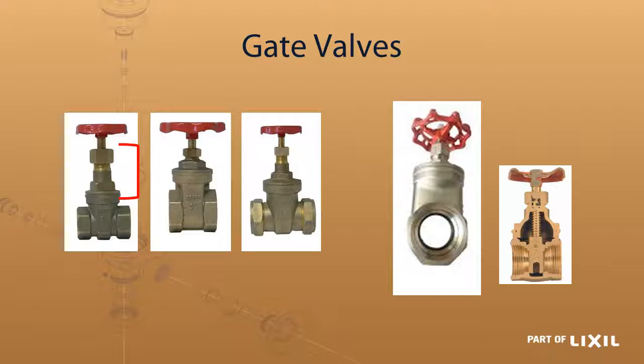The second one is the non-SABS one, which is the cheaper one that you would normally use in your agricultural installations. Both the first two — the 1001 and the 1002 — have got female threaded ends, BSP threaded, and are suitable for connections to galvanized pipe or any other pipe with an adapter fitted onto it.